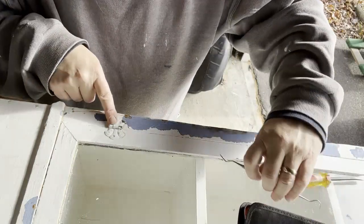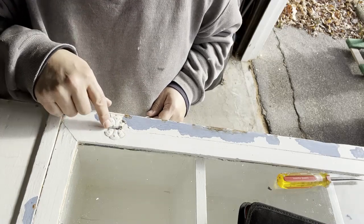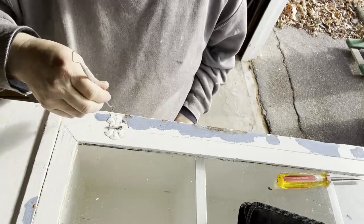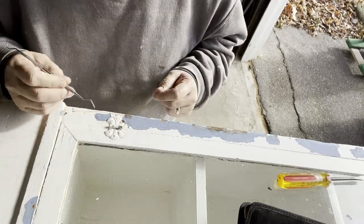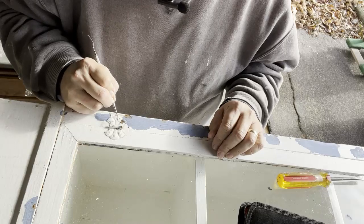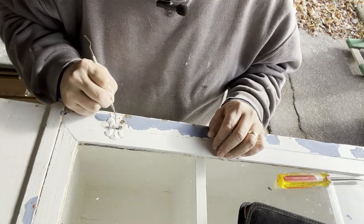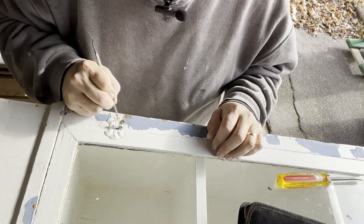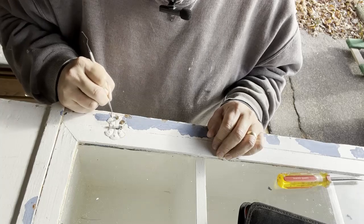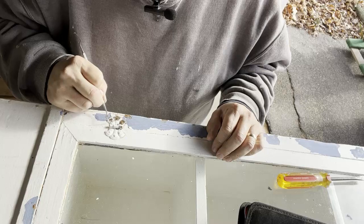The first step is to remove all this paint gathered around the hinge so I can expose the brass screws underneath. It's got a couple of layers of paint and I have this dental tool — it's two-sided with a good sharp point, and I'm able to scrape the paint away, being careful not to scratch the brass too much. It's tedious but necessary to get at the screws underneath. It appears to have been painted over with latex paint, so it's coming off pretty easily. Luckily there are only two layers of paint.